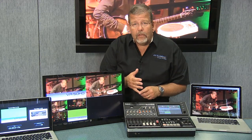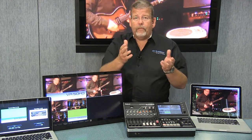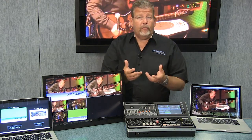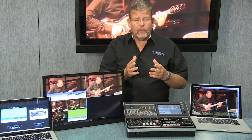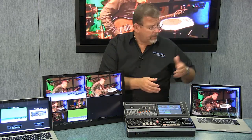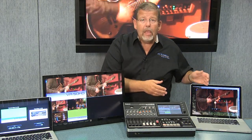It will take SDI signal, which is a digital signal. It'll take a standard composite video signal off of a Handycam or any compact video camera, and it will scale that up to high-definition. Of course, if you take a standard definition camera, you're never going to get a high-definition picture, but it will mix with other high-definition sources. It'll also send signals out in just about any format you want, including streaming.